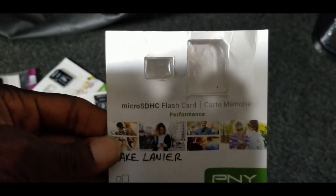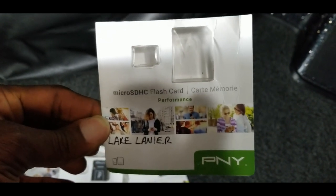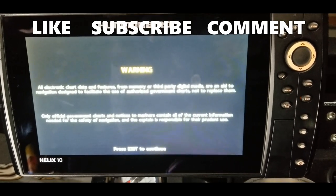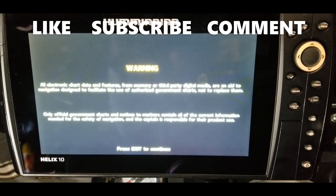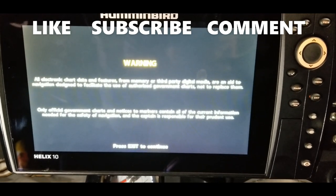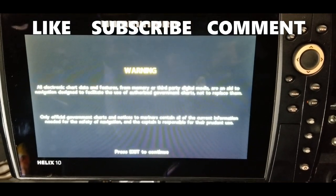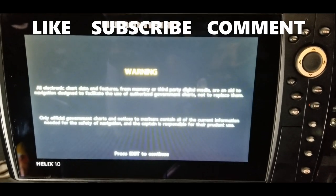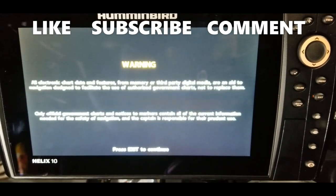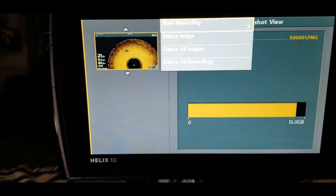We're going to concentrate on Lake Lanier right now. You'll notice the SD card is not in the bag because it's currently in the unit. If you lose those waypoints you are losing hours and hours, days of time, and a lot of money — because the time it will take to go back and replace all of those waypoints is basically years of work. You don't want to risk losing that, so I back those up on an SD card and also on a computer.